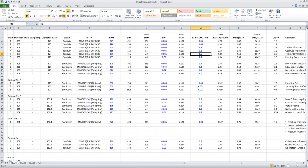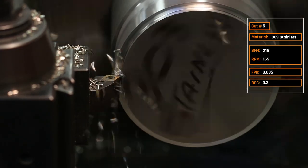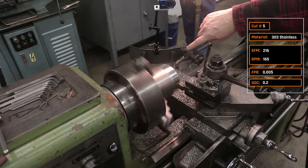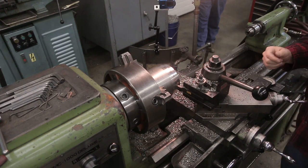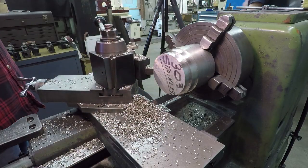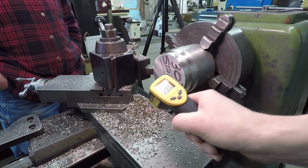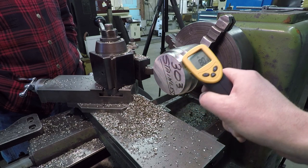These cuts are numbered because on the NYC CNC website there's an Excel sheet that highlights every cut by number — you can download it and use it for your shop. With a deeper depth of cut, even at the same material removal rate as going faster with a lighter cut, I'd argue it's better to take the deeper depth because you're using more of the carbide you paid for. At that depth of cut, you can touch the part and it reads about 80°F — but the chip pile is reading 294 to 380 degrees. That's proof in the pudding.